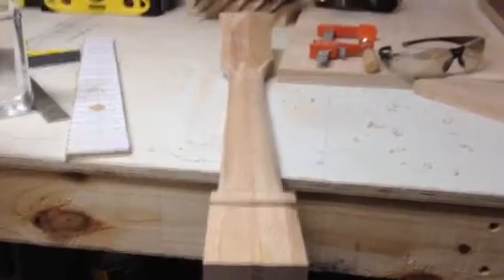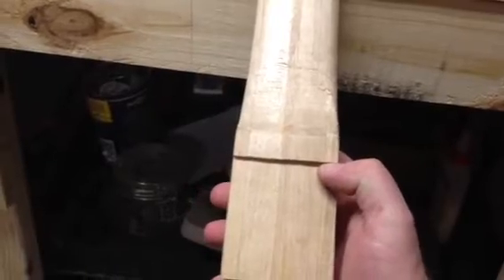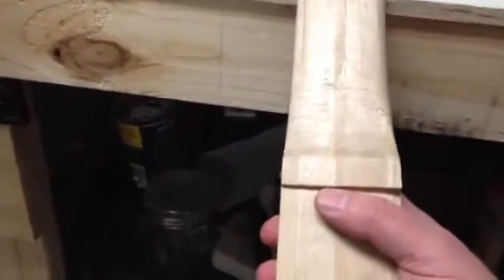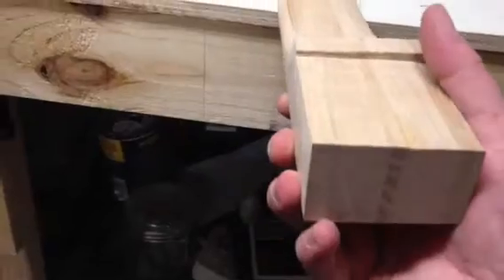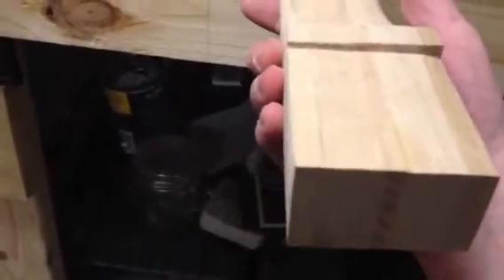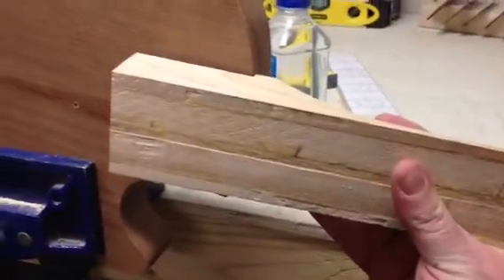I'm going to show my guitar neck, all the flaws, and what to do and what not to do. This line here isn't exactly perfect and I'm going to deal with that later — straighten it out with a straight edge. I'd just have less heel area there. To straighten that up would just be to make it straight, or make it conform to the body. It should be straight at the point where it meets the body, except for maybe an angle in, because when you set a Les Paul neck in it's got to be tilted a little bit back.